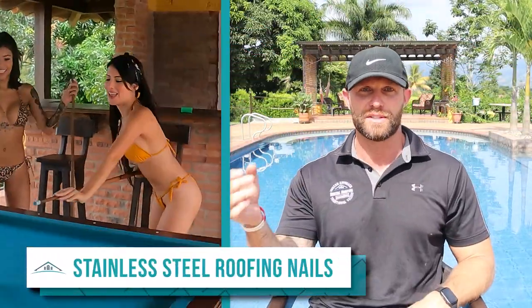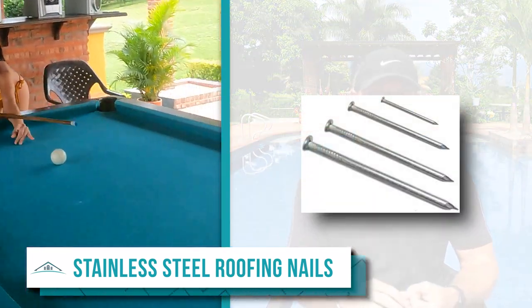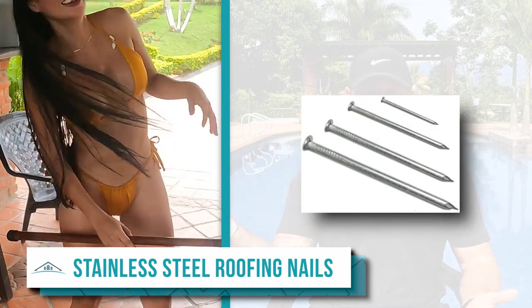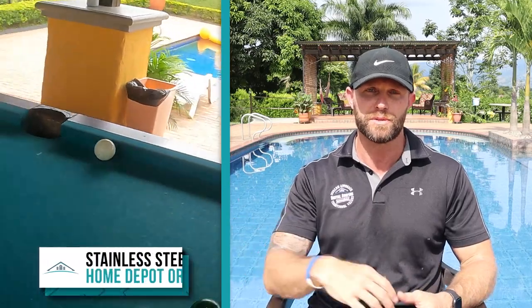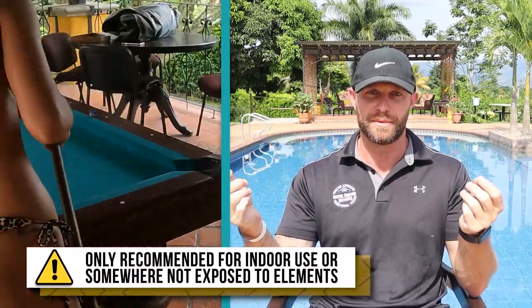Okay, next are stainless steel roofing nails. Now, this is the best nail to choose if you're installing a wood shake or a wood shingle roof. Stainless steel nails withstand all mineral reactions from the wood itself and also the lead in the rainwater. They're also available in various grades. Now, this is very important. So, number one, the lowest quality is just stainless steel nails from Home Depot or Lowe's. These are the bottom of the barrel in terms of quality. We only recommend them for indoor use or somewhere the nail is not exposed to the elements.